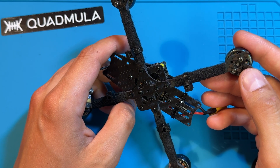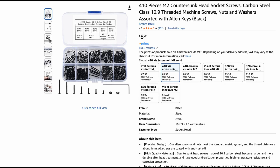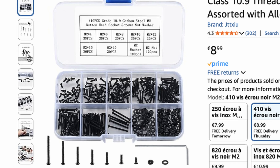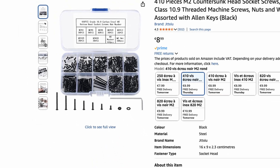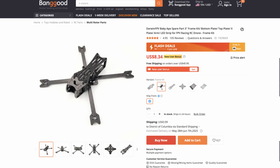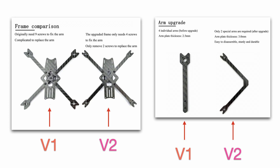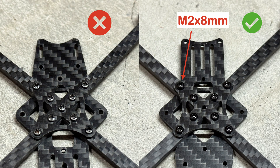If you're going to swap the OG motors with beefier ones, you should also get some 4mm, or even better 5mm, screws. Quick tip: grab yourself one of these M2 screw assortments — they're super useful if you're into FPV. And if you grabbed the version 1 frame because it's dirt cheap, you can ditch those annoying Phillips head screws and upgrade to hex screws. Way easier to work with and your fingers will thank you.